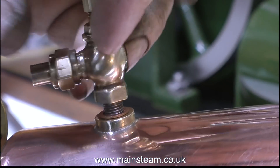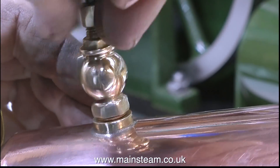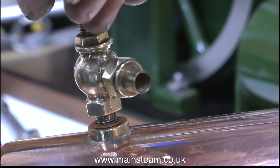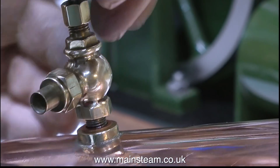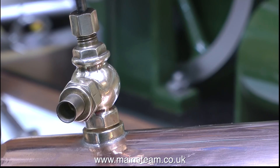It's now time to fit the tap into the top of the boiler bush. First I did a dummy run to make sure it ended up in the right place, and thankfully it did. Then I applied some Loctite 542 to the thread — this wonderful thread sealant will stop any chance of a leak, because the last thing I want is nasty streaks of white water residue down the boiler.